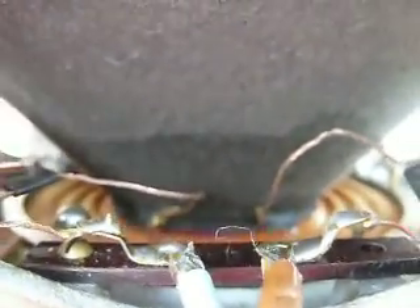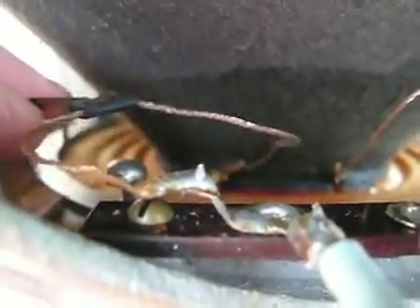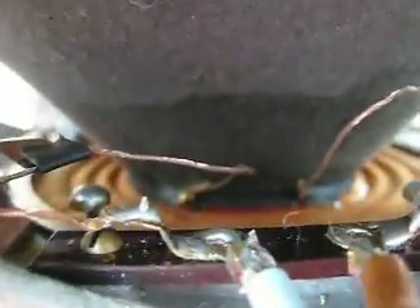I was asked to show more information on the voice coil lead-outs on these custom 18-inch woofers — field coil woofers with the Western Electric-style magnet. The lead-outs come out and go onto a copper strap here, an intermediate strap, and then they're soldered to there, and there's a lead-out and a solder joint there.